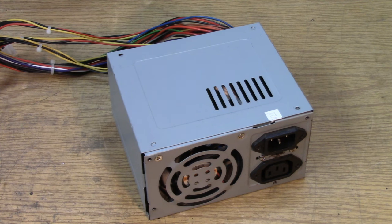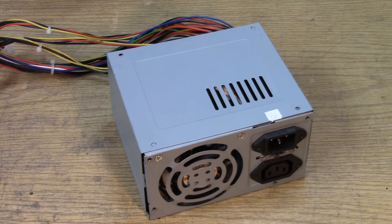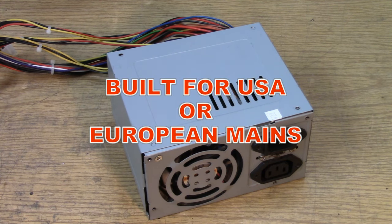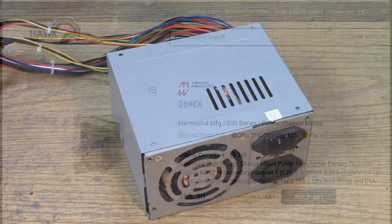So I thought I would build the power supply into an ATX box because it gives you the IEC inlet. And, you know, it's a metal box that's going to give us some protection for the high voltage circuitry. Plus, we can steal parts off the ATX circuit board to be used in the power supply. Now, the standard way of building a high voltage power supply doesn't really hold water when you're doing something this simple and this small. We don't have to go out and buy a professional power transformer for $100 for this project.